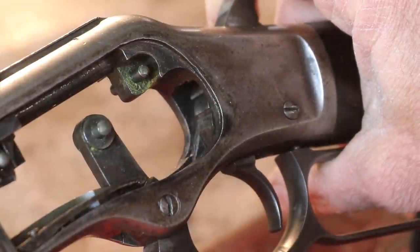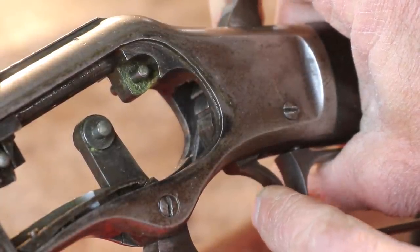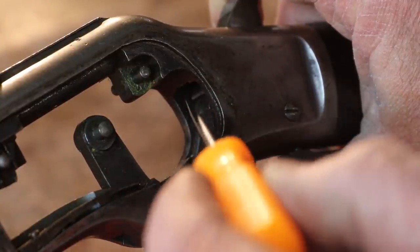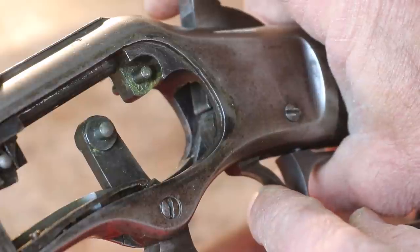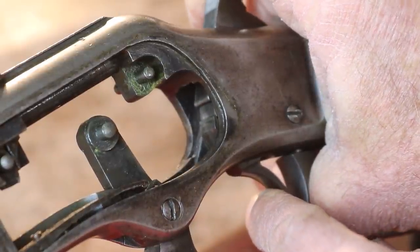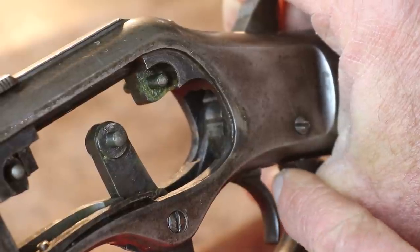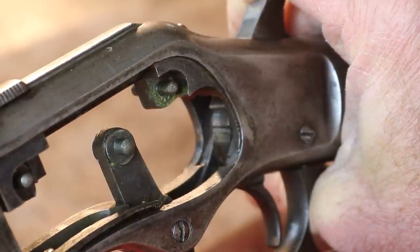Because this one has been cut off a little bit on the front, in severe instances we may even have to weld that up to build up more material. We'll try first to just deepen it - take some material off the back and deepen that notch that way. But if too much material has been taken off the front, what can happen is when we pull the trigger the sear hits that half cock notch on the way down and can damage either the sear or the notch or both. So there are some real issues here with hammer and sear geometry that we have to look at. Before we figure out exactly how we're going to fix this, let's get in a little further and see what that sear spring looks like.